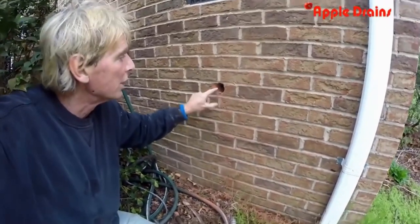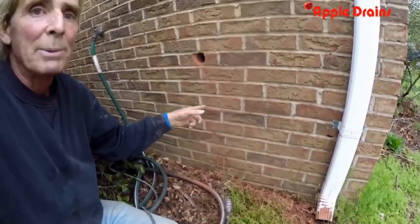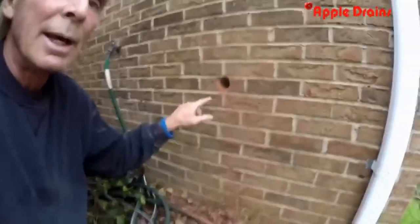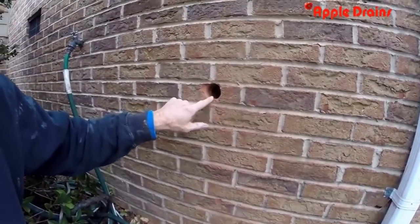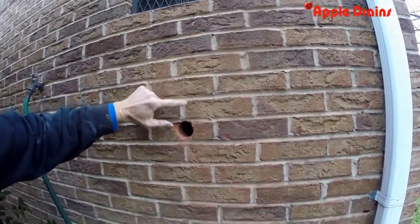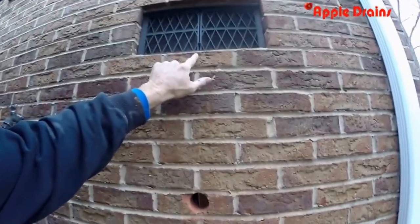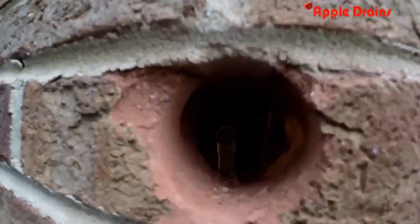Let's review, because this is a really important piece. In order to find the measurement for the discharge of the sump pump, remember the pump is down inside the crawl space. There's going to be a pipe that comes up — we need to bring that pipe out and join it to the downspout drain which goes out to the street. We came straight down the center of the vent, and if you look inside you can see our 90 ready to go. Making a measurement is not that hard, and we're pretty exact when we do it.